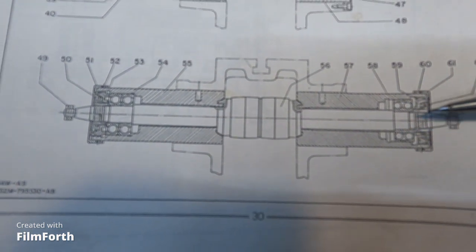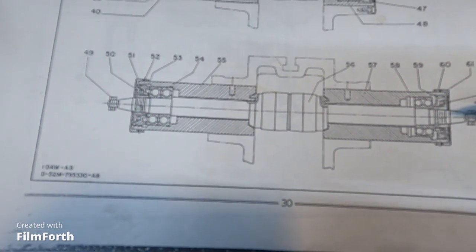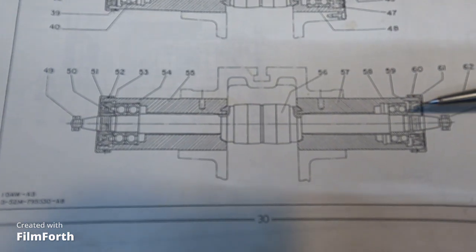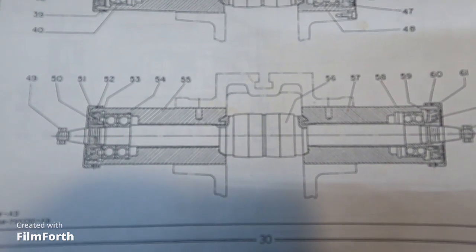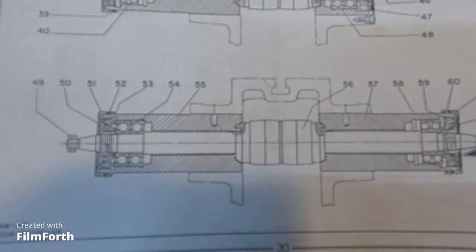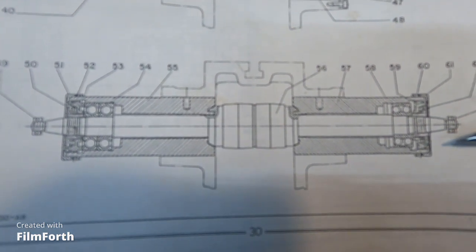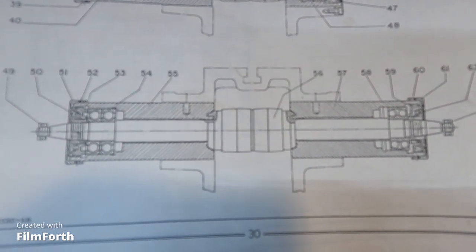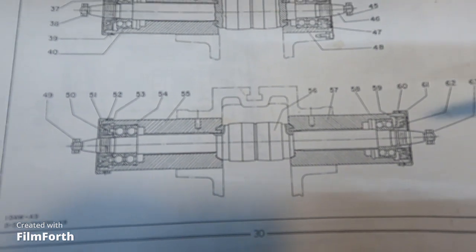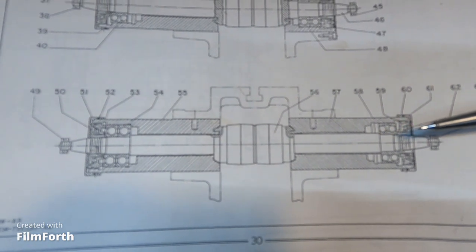The unit bearing is allowed to float. The shelf life of ultra-filtered grease is about five years. If you take these grinders from the 1950s when they started grease-packing them, the grease is now about 70 years old — so the bearings are going to fail on grease-packed machines.